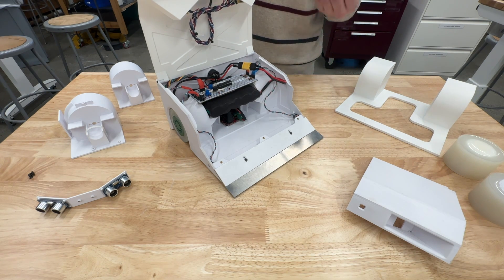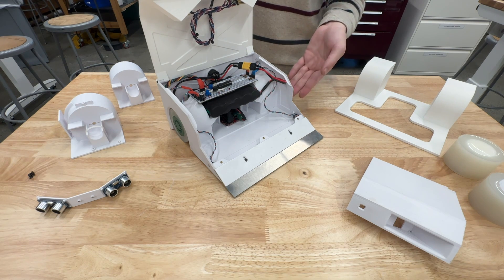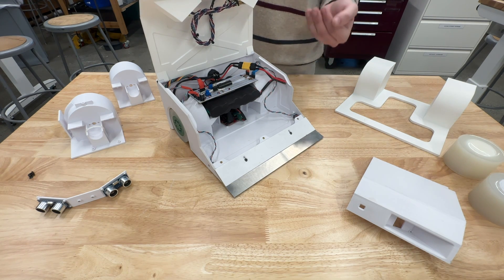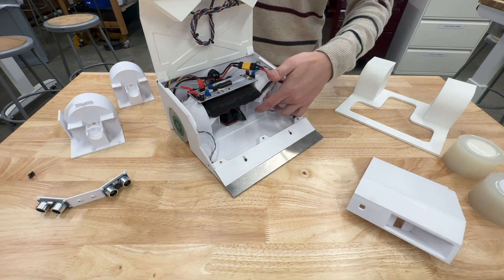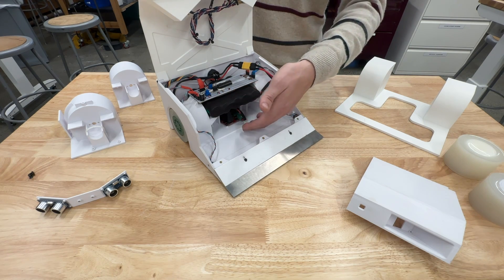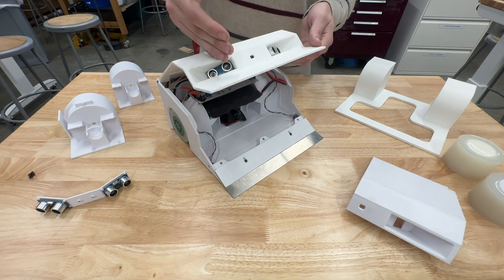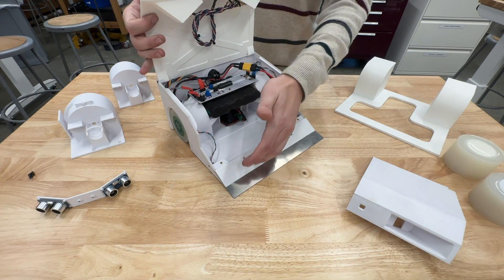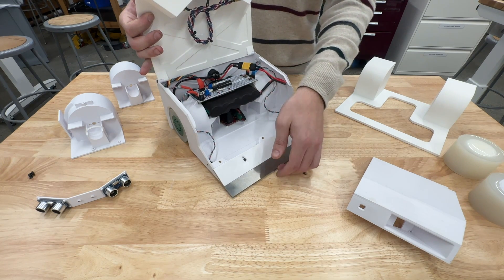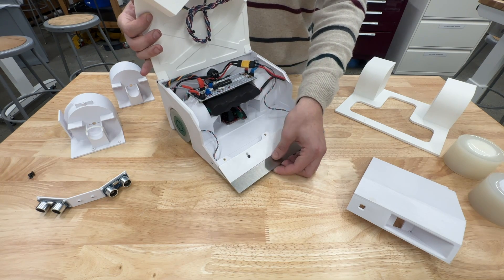As mentioned, we wanted to come up with a super simple and robust design, and I think we did a great job, only having really three main parts that constitute the structure of the chassis. One being the main monocoque structure that houses the wheel wells as well as all of the mounting points for the electronics and battery. Then the hinged lid that consists of the sensor mounts and the cover for the rest of the robot. Finally, we have the wedge clamp that clamps a thin 1/64 inch steel sheet onto the chassis.